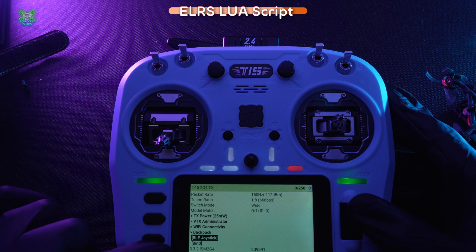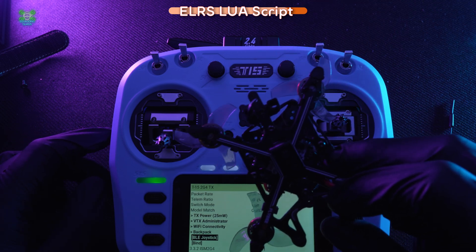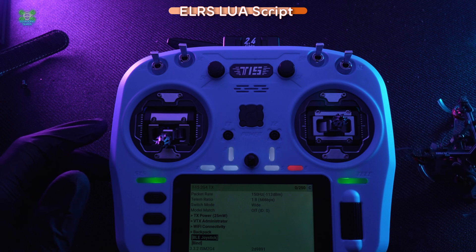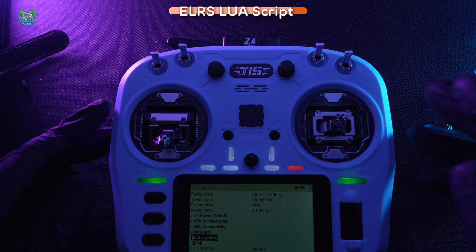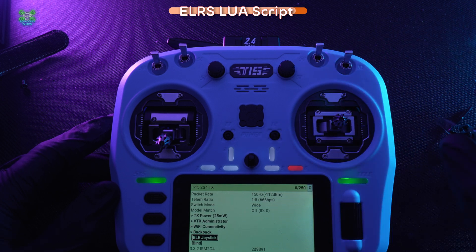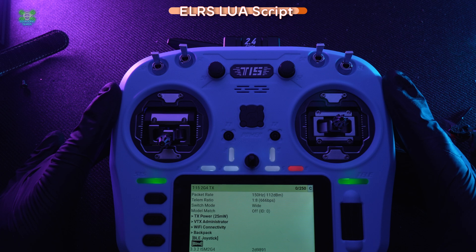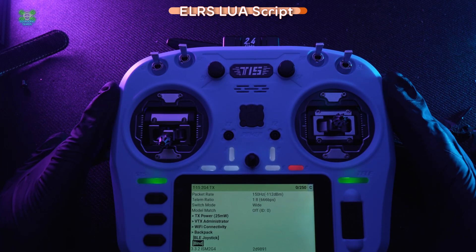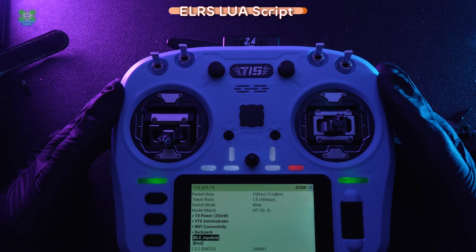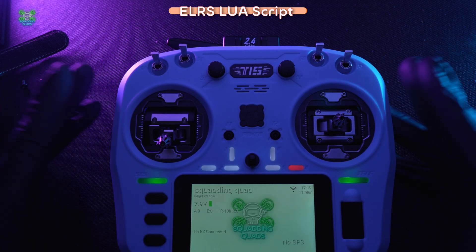The Backpack I won't go into now either. The important thing to know is it shows we're on ELRS 3.3.2 — and that's important because if you've got a quad shipped with ELRS 2.x, you wouldn't be able to bind it to a controller on ELRS 3.x. Someone in my comments a few weeks ago said a quad I recommended wouldn't bind with their controller — it was because the quad was on 3.x and their controller was on 2.x. I think the next episode will cover how to update everything in ELRS, because it's such a fundamental thing.